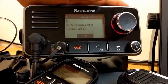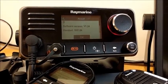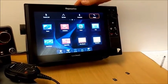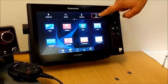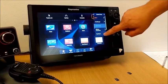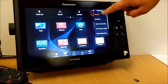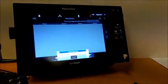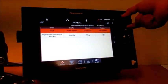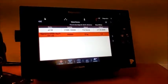Don't forget the bootloader file, which we have to upgrade first. Coming around to our multi-function display — this is connected to the radio via a small SeaTalkng backbone with its own terminators, power, and the expected parts connected. Going to setup, maintenance, diagnostics and select device — I can see my ES128 and my Ray 70 VHF running application 1.24.